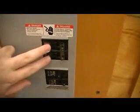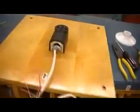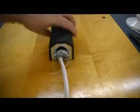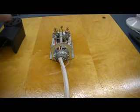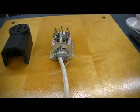At the panel, you will be using a double pole breaker because you have two hots for your black wire and red wire. Very simple project — the easiest one you'll have to do all semester. Just remember, no hooks with this; you just slide your wires right up under the screws and tighten them down. That's it for project four, which is the dryer receptacle, 240 volt receptacle circuit.